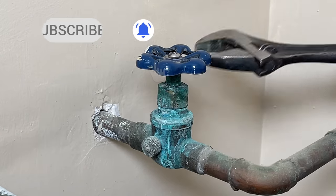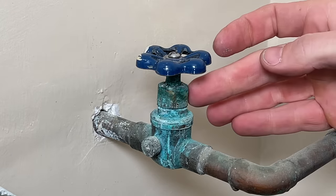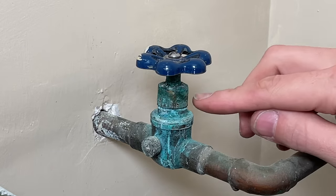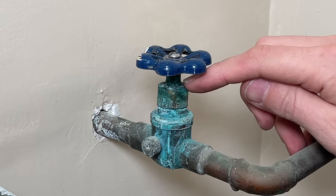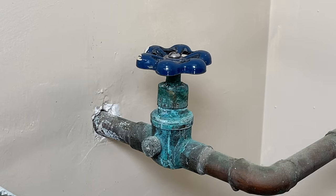For me, my packing nut is at the end of travel, so this really isn't going to do much. But hopefully just tightening this packing nut will stop that water leak at the stem and be an easy solution for your problem.